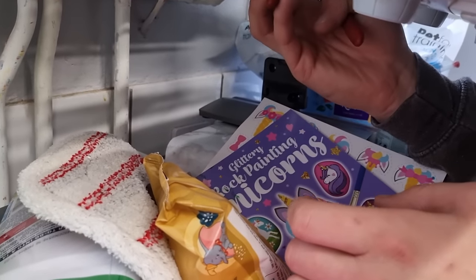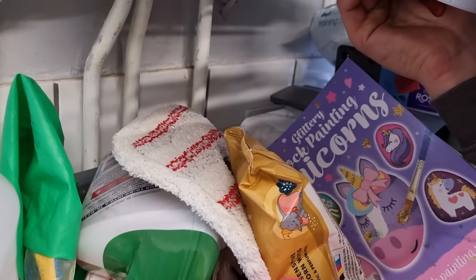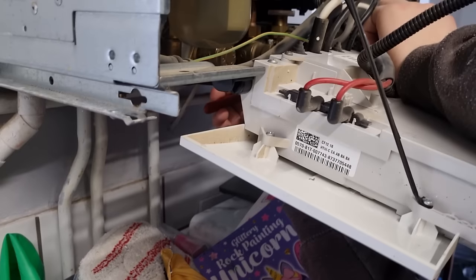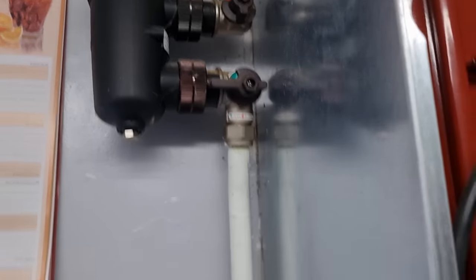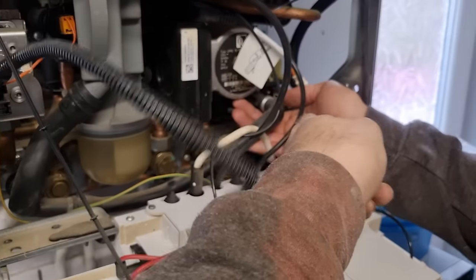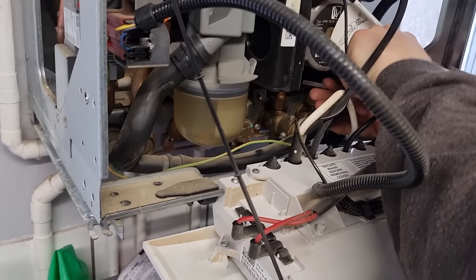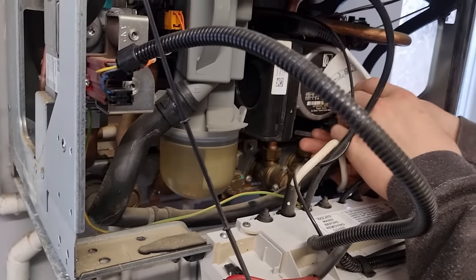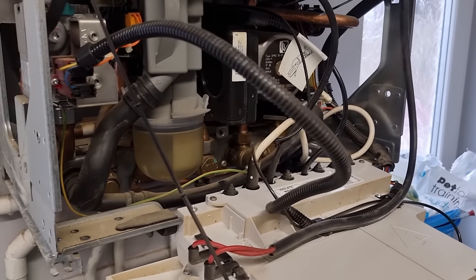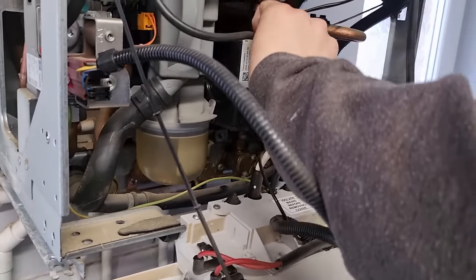Can you get them? They normally turn towards you mate. Which one is it? They'll only go one way - there you go. That was not moving. We'll isolate the return on there because that valve doesn't want to turn, but we can get the flow. Twist it towards me, that should open. Sometimes a little bit stiff mate - sometimes you need to get a bit of grips on them. There you go - pressure should start to drop.